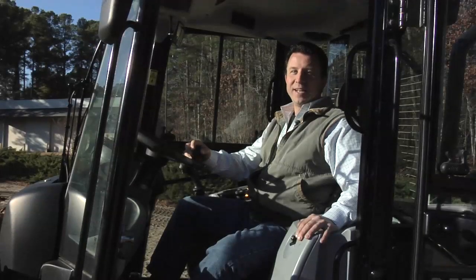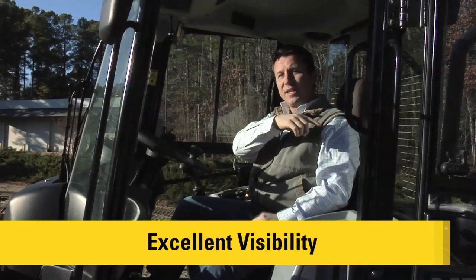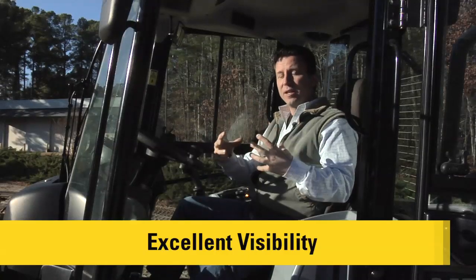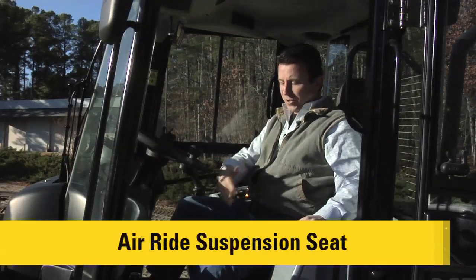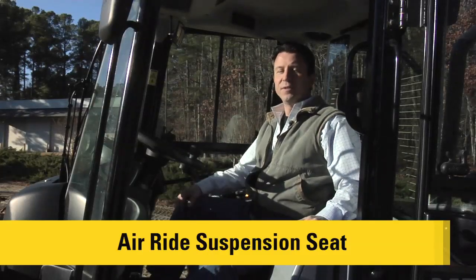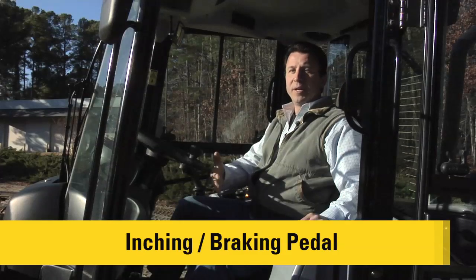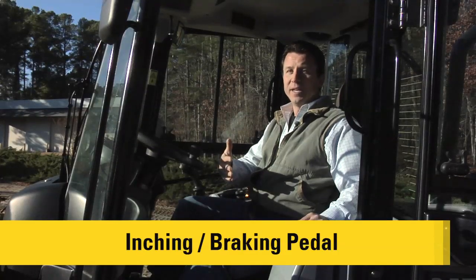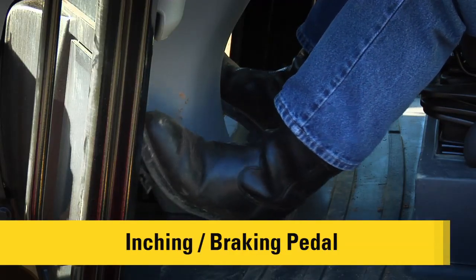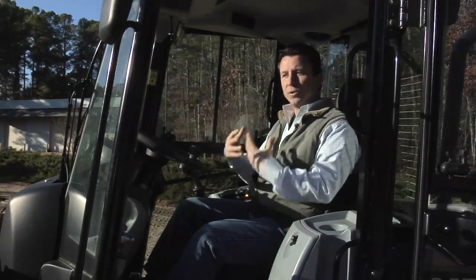Let me take you through this new K-series cab. We have a very wide, open area for sight lines to the loader. Over my shoulder I can easily see to the left side or the right corner, seeing that rear counterweight — giving confidence of great visibility to the rear end. The air-ride suspension seat has air adjustability and lumbar support. Behind the seat there's a switch for a heat function for cold winter days. Another nice feature is the inching-braking pedal: half of the pedal is the hydrostatic decelerator, giving decel and hydrostatic control, and beyond halfway you get into the mechanical brakes. An operator can modulate between throttle and hydrostatic deceleration all day long without wearing out any components.